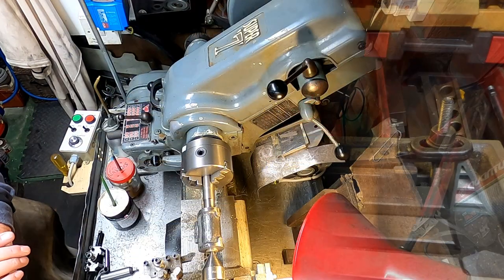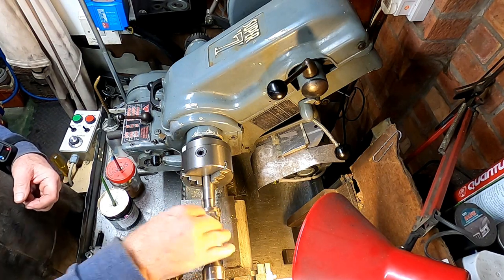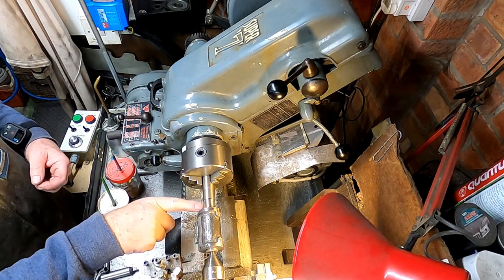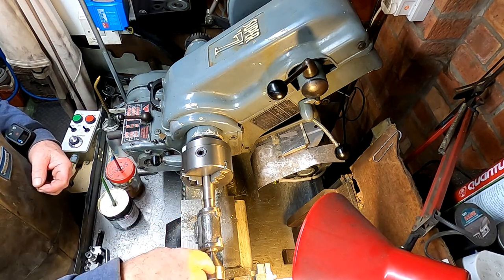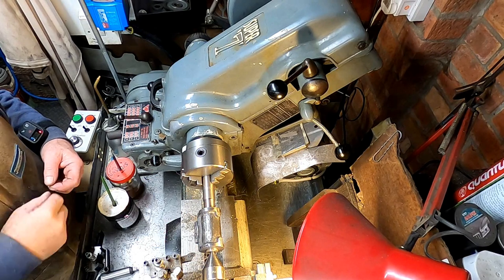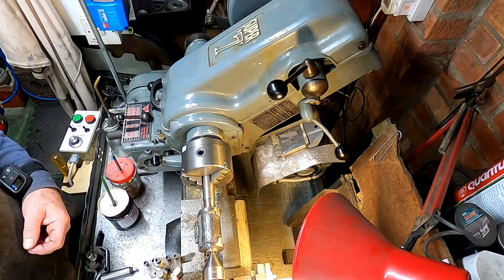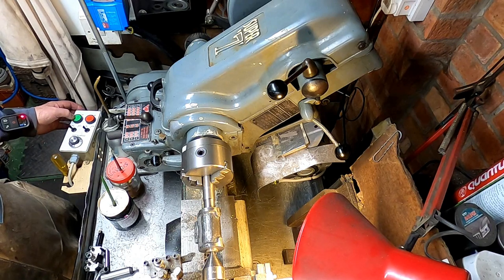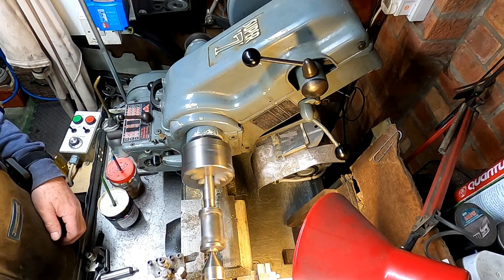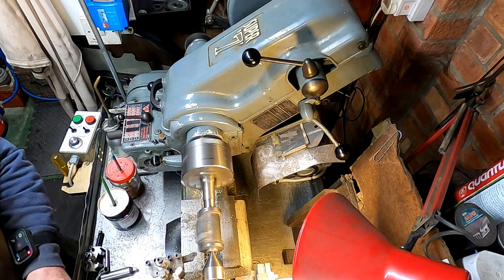Very good. Because Stuart castings are so good, I've just been able to clean out the bore of the cylinder with some files and a rough stone, and I've made up a mandrel that's running true in this chuck with the rear centre, and just actually effectively driven the cylinder casting onto the mandrel in order to clean up the two end faces so that I've got some reference surfaces. So that's what we're doing. Just need to go a bit steady and not take too heavy a cut.